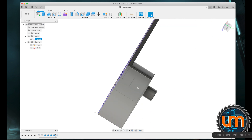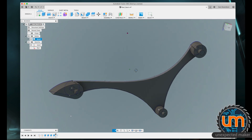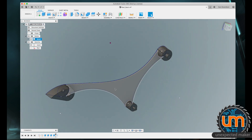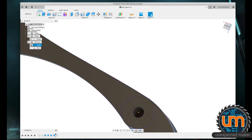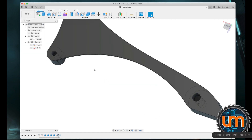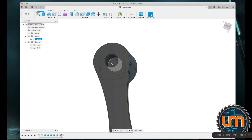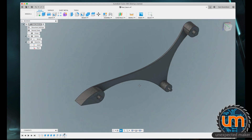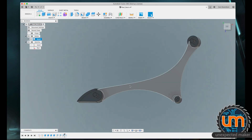Will it be enough to hold them together? Probably not. But I don't want to get this cavity inside too thin. The idea is to put them all together and not necessarily glue them — just have them sit together with friction. I might have to make those holes a little bit wider, just to make sure that they fit. So I'll turn off the sketch and use the push/pull tool, going negative 0.1 just to make it a fraction wider. So we now have a stand designed for an 8mm reel. I'm going to print a couple of these and see if they fit together.